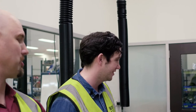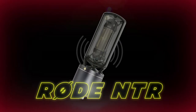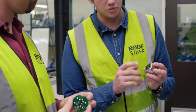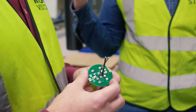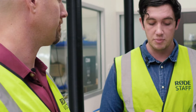This room is our transformer manufacturing room — you can see copper and giant magnets everywhere. This is the newest space at RØDE. We started manufacturing transformers for our NTR ribbon mic — this is the RØDE TR1 transformer, and it's heavy. One of the challenges with bringing out a really nice ribbon mic was that transformers can be very expensive to get well-specced with a really low impedance, so you don't have the signal struggling through the transformer and generating a lot of noise.